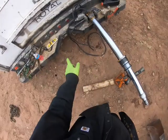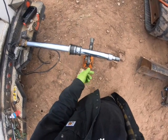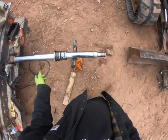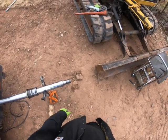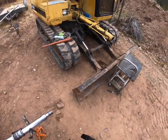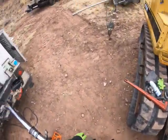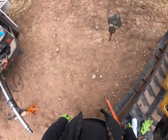So all I did is grease up the inside really good, just with some assembly grease, and then just some hydraulic oil and just slide it on. I got the threads really clean on this because, you know, I didn't melt the lock nut, but lock nuts usually aren't really designed for multiple use. Some of the Teflon came out, so we're gonna thread lock it back on.